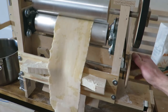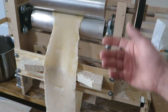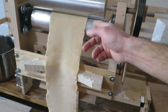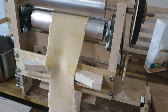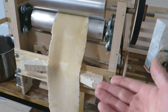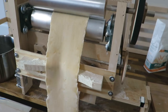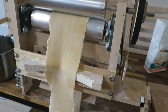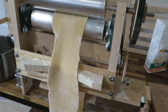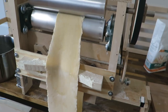Well, as the thing is rolling, I need to adjust the pressure or the gap. It's more like you're adjusting the pressure when you are rolling the final whip. The gap is 0 millimeters practically, so it's the pressure. I guess this could be automated because both my hands are free now, but this can go wrong very quickly. Also, it doesn't take too much time to roll the dough to its final length and thickness.